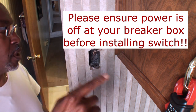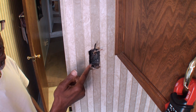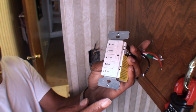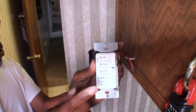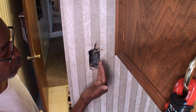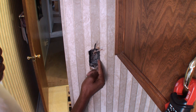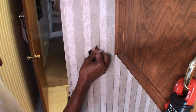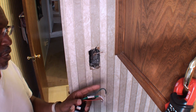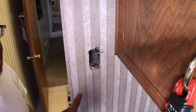I'll have a video link below to a gentleman that kind of got me on the right track with how to wire this thing up. I had hit up several electricians on YouTube that were wiring this exact switch timer in, but they were doing it on a wall outlet that had multiple things hooked up, so they actually had a common inside the box. But in my situation, it's one piece of romex with a black, white, and a ground, and that's all that's in there. There's nothing in the instructions on how to make this happen.